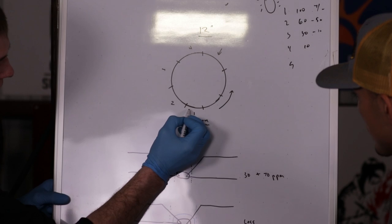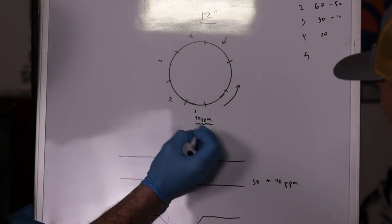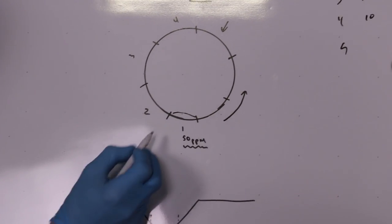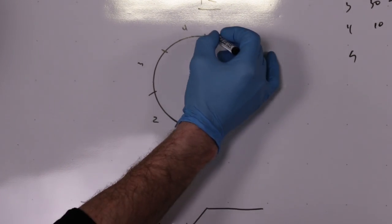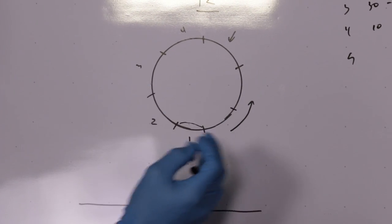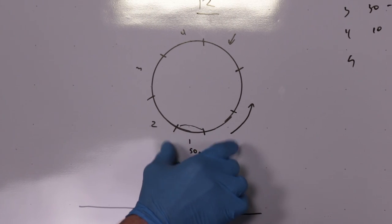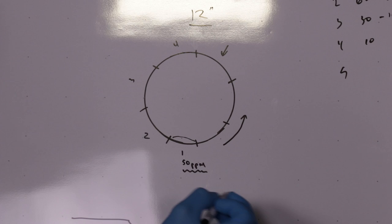When you start welding, remove a little bit of tape at the bottom because the bottom is going to be the very worst parts per million of oxygen. Say you get hypothetically 50 parts per million. You'll weld the bottom first, then depending on where you adjust the heat, you might weld down here and up here, welding different areas of the pipe while allowing previously deposited metal to cool down. You're also countering the influence and effects of gravity and how the material sinks on stainless.